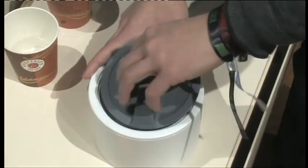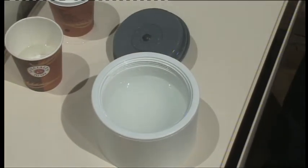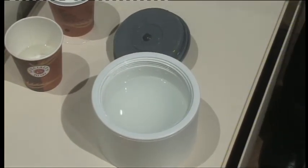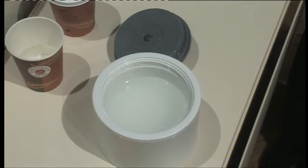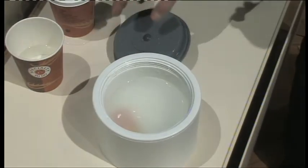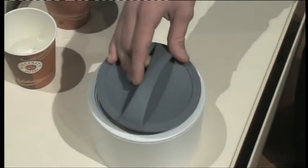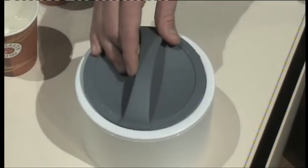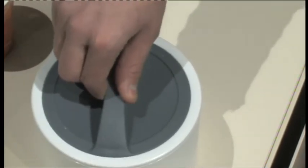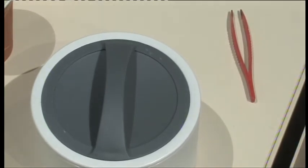Here's the etch solution — we've got this insulated bento box which is going to keep the etch nice and warm. The speed of the etch is pretty much just dependent on temperature, so this is about 40–50 degrees. We'll chuck the PCB in and Rob here is going to look after the etch process. We'll show you what it looks like at the end. It's nice and simple — we just chuck it in the solution and occasionally swirl it around. We'll switch back to the slides now.